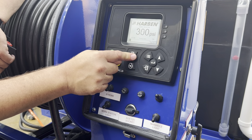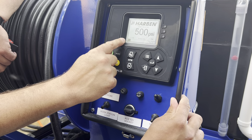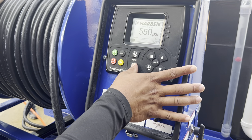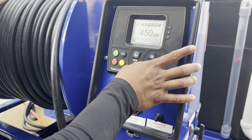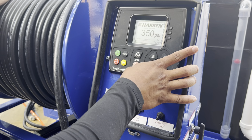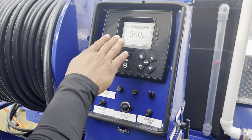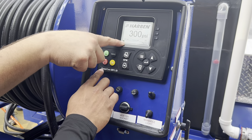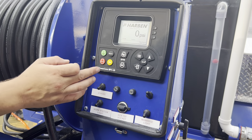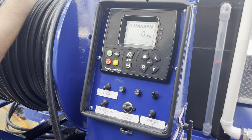It's already revved all the way down, so I'm going to hit the rabbit. The RPMs are directly correlated to the PSI. Just make sure it's revved down before you turn it on and off. It's about 1,250 RPM when it's down, so you can see that it's down and you're good. Turn the water off first, then shut the engine off — because that toggle is now toggled open.